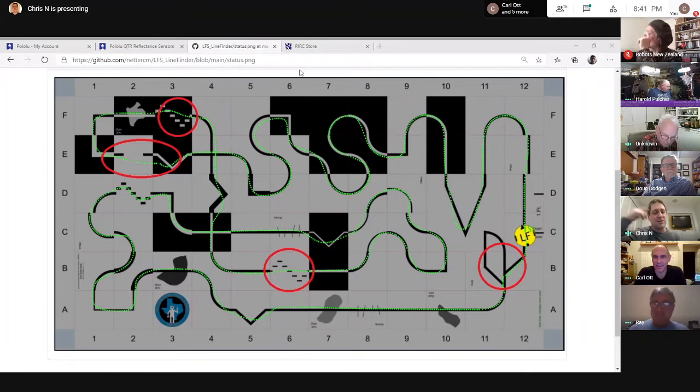I heard what you just said, Carl, so you did it the computer vision, manual feature extraction kind of way, right? But that's what the convolutional neural net is doing for you. So you let it figure out that edge detection comes in handy to detect this sort of pattern. It's learning all these filters that you manually apply. You would do a convolution with a kernel that ends up giving you edge detection, a simple example. The convolutional neural net figures that part out for you. So I really want to try that out.